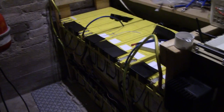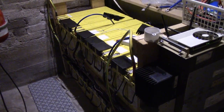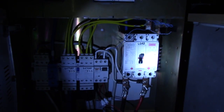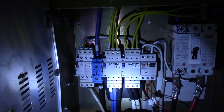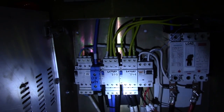Because here's the rest of them — I think I have something like 36 in total. And this is my current solar system. We've got the Morningstar TSMPPT-60 controller sitting here on an electrical box, and we've just got some heavy duty control stuff — breakers and so forth. In here, that big breaker there is the main battery breaker. Then we've got two sub-breakers, which allow me to divide the batteries up into two strings and disconnect three parallel series at a time.